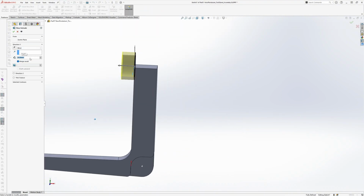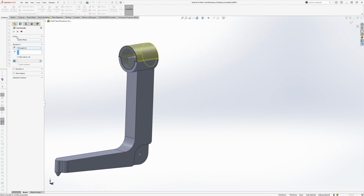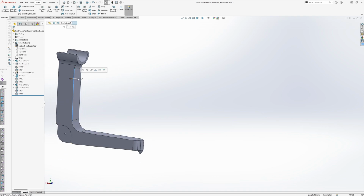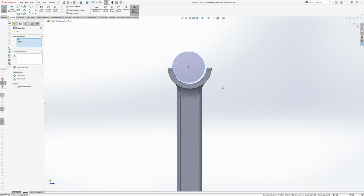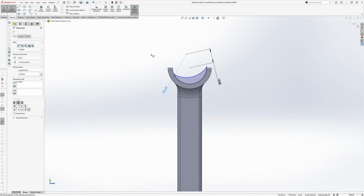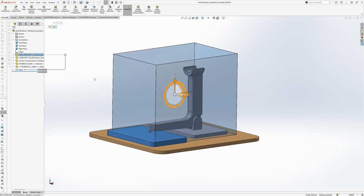And next I designed the motor mount. For this setup, I'm using a simple cradle style mount, so the motor will sit in and it'll be held down with cable ties. I'll also add a small wall in the front for support so that the motor is kept from sliding forward. And since we are 3D printing the parts, I'll go ahead and add some fillets.